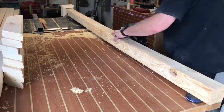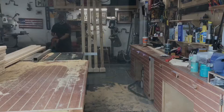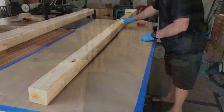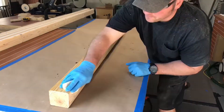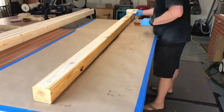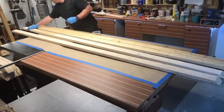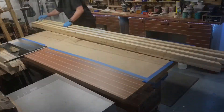I also put that 45 degree angle chamfer on the four by four post as well. Using a sander and a router and not cleaning up after yourself, you got to get it done — makes it a mess. Now for the finish. This couldn't be simpler. This is just boiled linseed oil applied very liberally to the four by fours and the two by fours. Wipe it clean and I'll let it sit overnight.